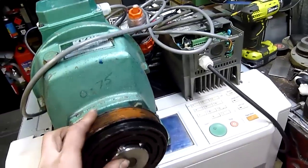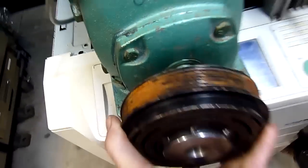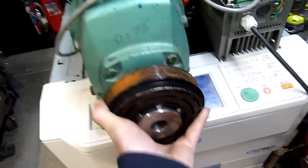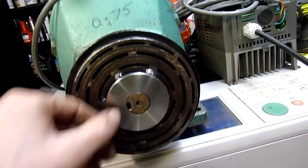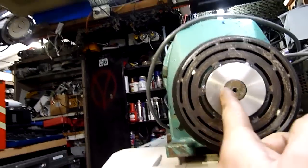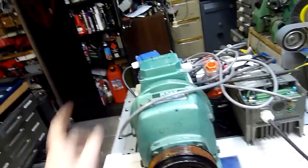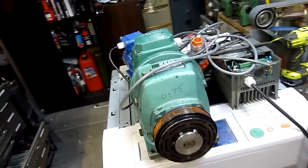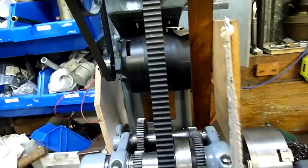That's a nice fit - it's not tight, but there's still a bit of rust on there. It'll loosen up a little bit, but essentially what I'm going to do is blue loctite and a hemispherical half key. I'm not going to bother taking it to work and EDMing it. I'll put it in the mill and plunge an end mill down about halfway through here, put a hemisphere key slot in it and a grub screw driving into the key. It's more than enough for the amount of power going through this - only 0.75 kilowatt through the reduction on a lathe with a belt drive. The belt's going to slip or the VFD will trip out before anything horrible happens.